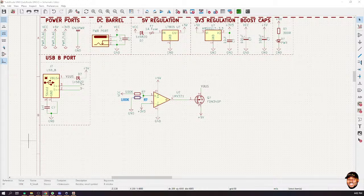It checks for overcurrent. So surge protectors deal with voltage spikes, but a fuse deals with overcurrent. For a fuse, when the current exceeds its rating, it has to break down and disconnect your system and make sure it is safe. But surge protectors are always there actively doing their work without shutting down your system. The main difference is that surge protectors are flattening or smoothing out spikes. We call them voltage spikes. So that's it. Please, any other question? Or any other idea?